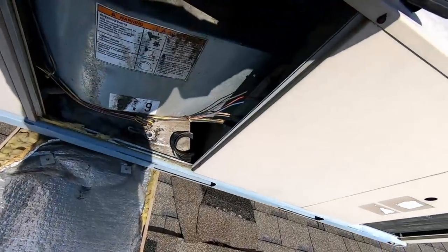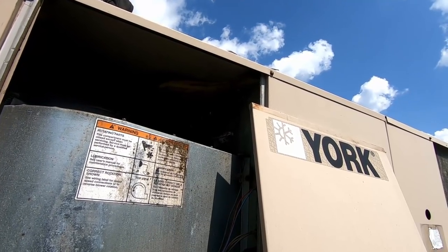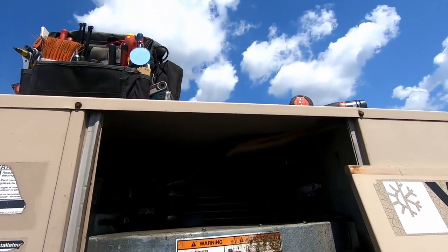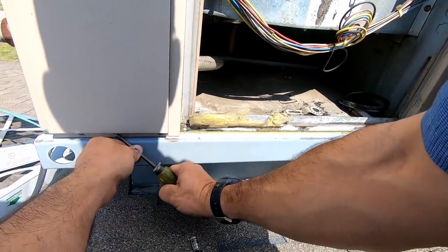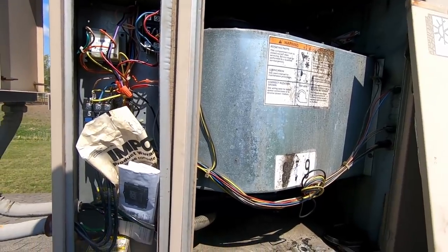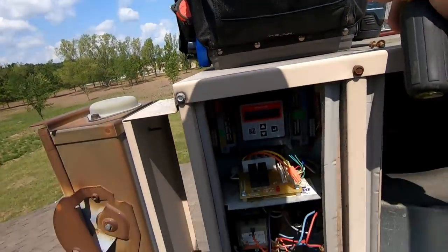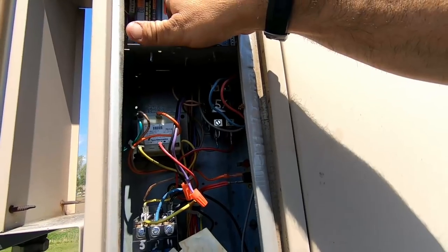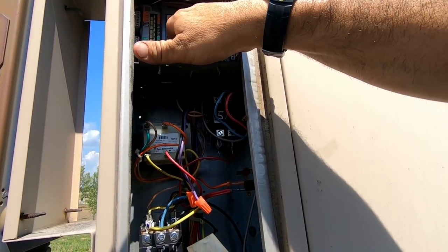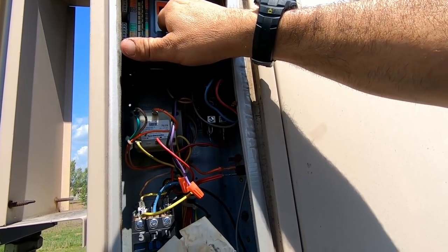Okay, she's got a ribbon with two pressure switches there, which looks like one. It's probably a fan cycle switch, and the other one's probably a high pressure cutout. There's a freeze sensor over there in the back corner. It's hard to believe — they do pretty good on their commercial stuff, just not this garbage. But you actually do have a Jade controller in there. I wonder who updated that. Fancy Nancy.